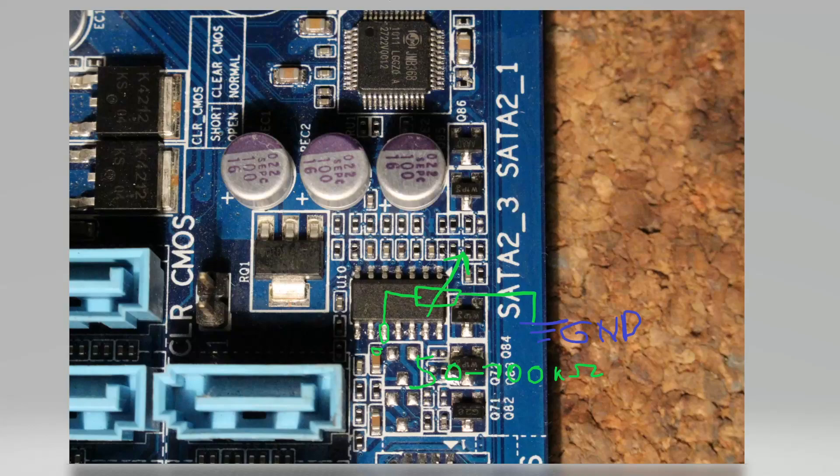For ground pads, there is a screw hole up here somewhere. Personally I used — if you maybe saw it in the video — there is the 24-pin up here and there is an MLCC right below the 24-pin, and the right pad of that MLCC is ground. So that's basically your ground point on this.